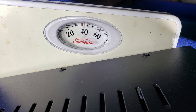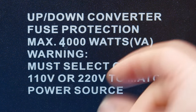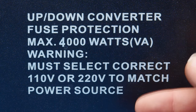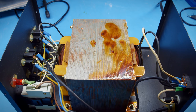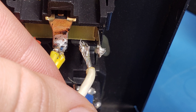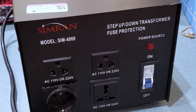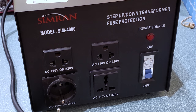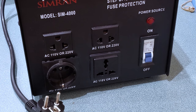After a while I gave up filming just so I could fix everything without being distracted by the camera, because I really needed to heavily scrutinize everything in there. The wires not being tinned or connecting poorly are a huge risk in something like this. At 40 pounds this thing obviously isn't subject to movement fatigue or vibrations, but it is a high power device and every marginal solder point is effectively a resistor that will heat up the more power you draw. If that reaches a failure point, the loose wire could float around and cause arcing inside. This is without a doubt the worst built and most dangerous device I have ever seen.